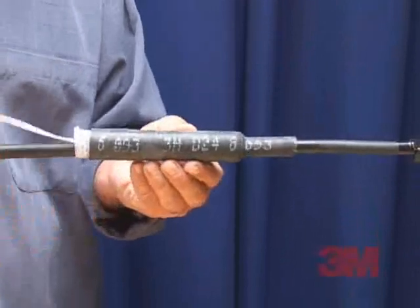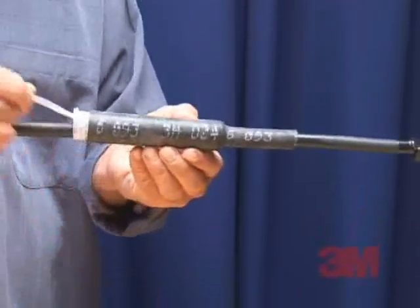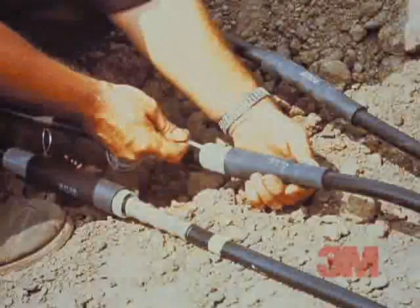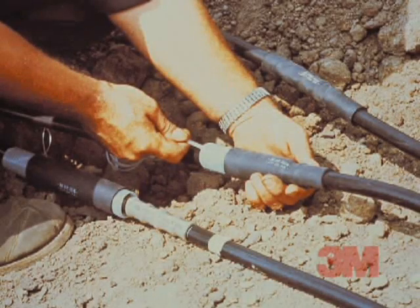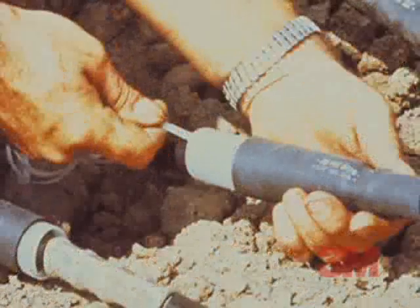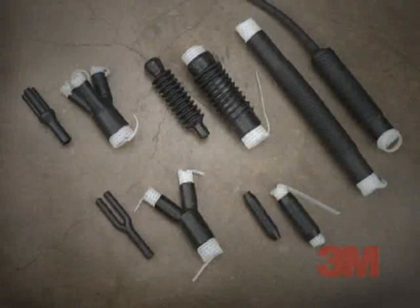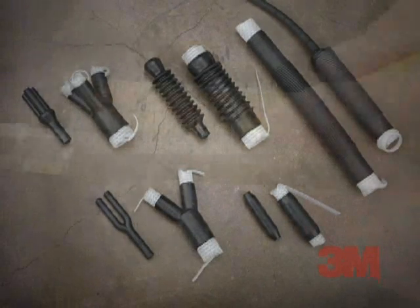The core can be easily removed, letting the insulator shrink into position, forming a durable, compressive environmental seal and reliable insulation. The 3M brand cold shrink insulator 8420 series meets the requirements of ANSI C119-1 and Western Underground Guide 2.14 for secondary splices rated up to 1kV.